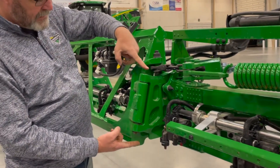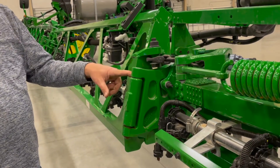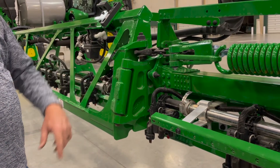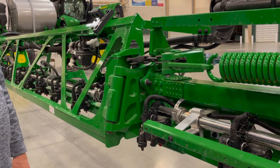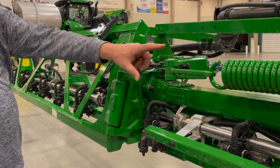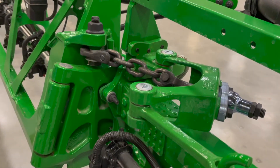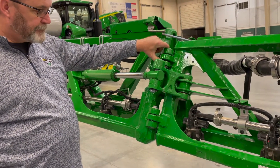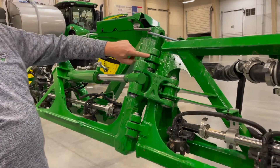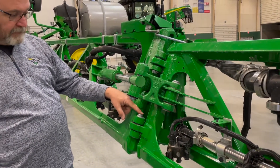The two breakaway pins — front and back — are the pins that take the most abuse and that we change most often, because the outside of the boom is flopping up and down, hitting terraces. We also have bushings in the breakaway spring controls. On your midsection pivot, we have those pins and bushings as well — no grease zerks, so these have to be maintained. You'll pick up the boom and see if you have play; it's easy to tell.